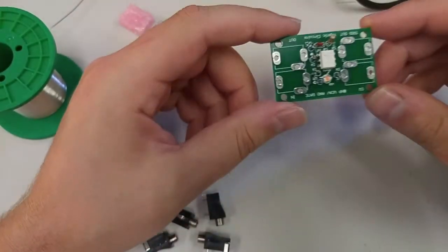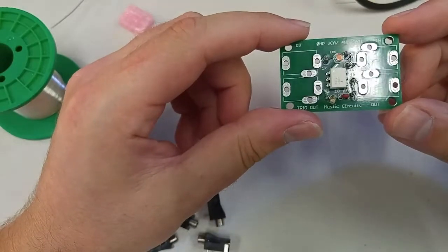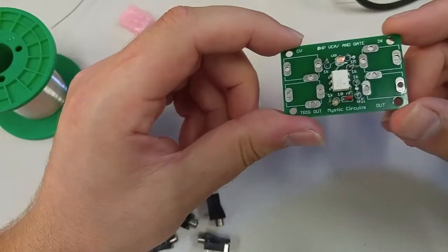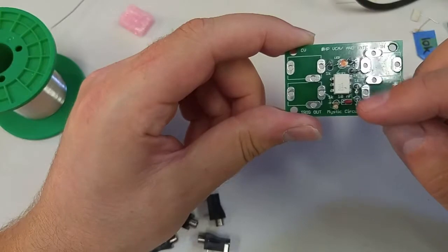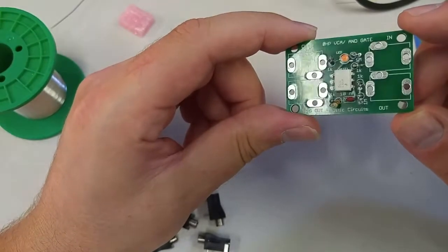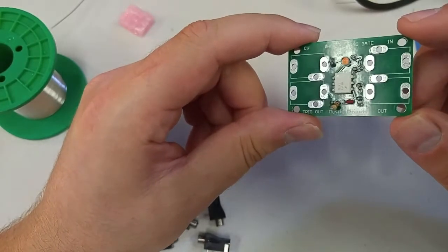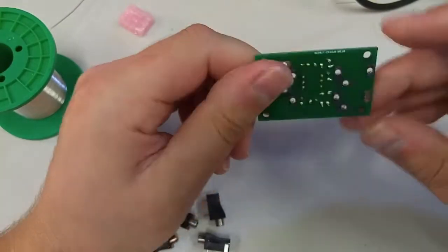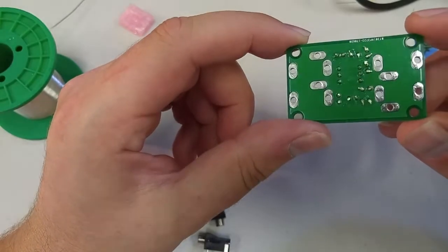Anyways, before we go any further, you should double check that your board looks like this. Pin 1 facing CV. Your resistors are all in the right place, facing, they could be swapped around, but they're going between the right pins. Capacitor at the bottom. Big pink LED at the top, looking nice and pretty. And nothing on the bottom, no pins touching each other accidentally.